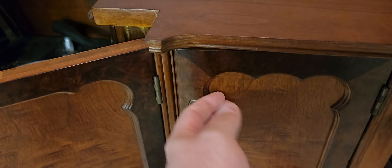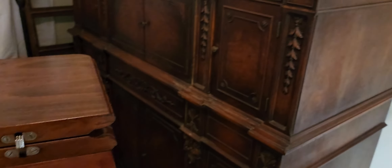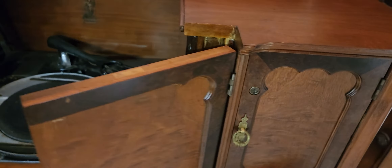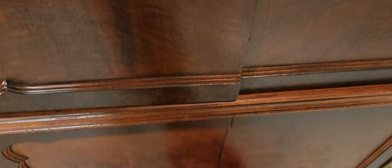The second feature is another lockout — you can see a lock right here on the front, and on the inside you can see where it engages and disengages in this insert. I know a gentleman who has a Capehart 500 Empire cabinet with the same feature, which leads me to believe Capehart allowed customers to customize however they wanted. That lock originally connects to the AC power line as an interlock — so if you wanted to prevent someone from manipulating the machine, they'd need a key to turn on the Capehart.